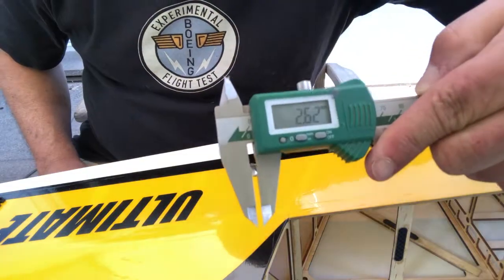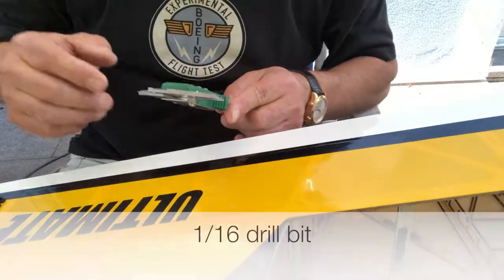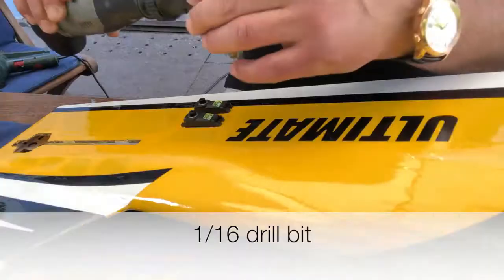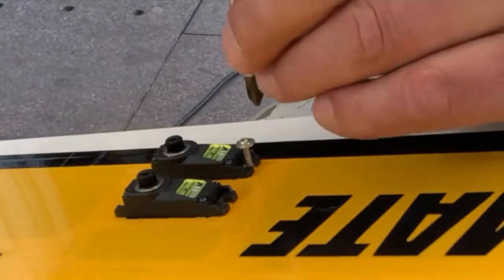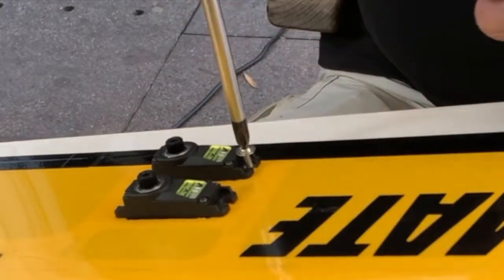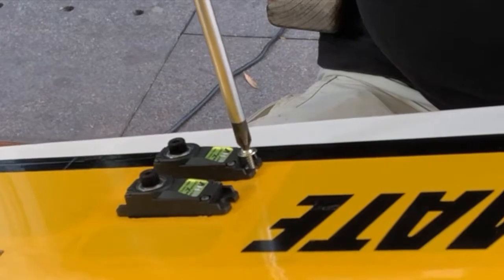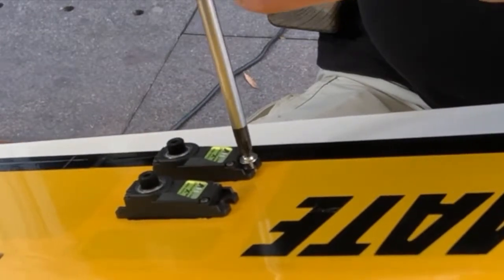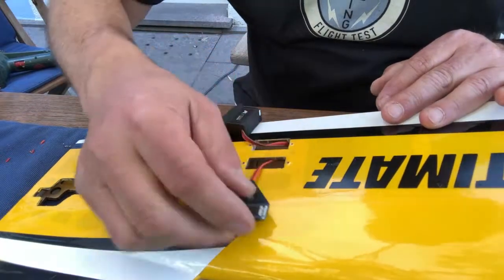The screws are actually 2.6mm in diameter, so I will drill 1.8mm holes. Be very careful when drilling — take your time, you can break things easily, so don't apply very much force. The same applies with the screws when you cut the threads. There is a bit of carbon fiber underneath as well, so you want to go back and forth and carefully cut that thread.